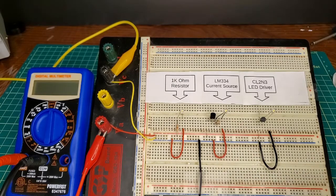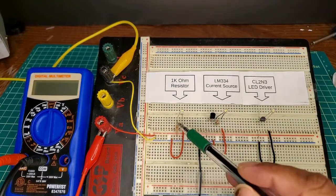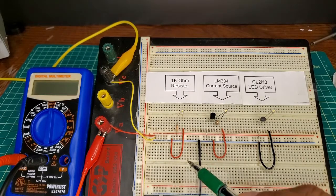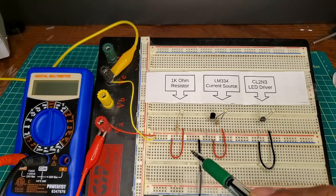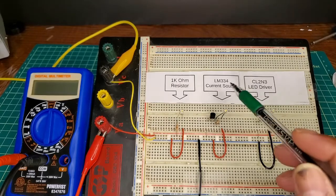For the resistor method, a 1 kilohm resistor gives about 8–9 milliamperes at 12V input. I've also used 560 ohms, which gives a bit more current — still safe as long as you don't exceed 20 milliamperes, which is the ideal operating current for most LEDs. The second mechanism uses a current source — a device designed to control the amount of current it releases at its output — and it's adjustable, so you can control exactly how much current goes to the LED.